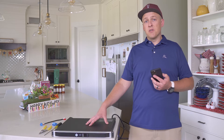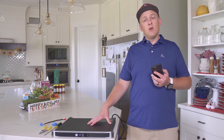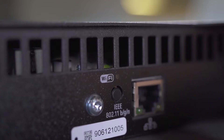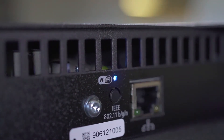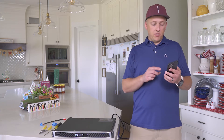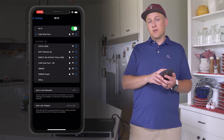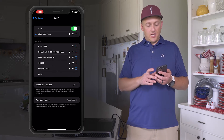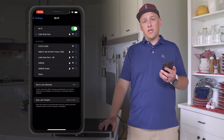For this project we don't have a network switch nearby, so we're going to use the built-in hotspot to load the DSP presets. Plug in the power, then reach behind the amplifier and press the Wi-Fi button. Once it turns blue on the front of the LEA amplifier, it starts broadcasting an SSID unique to this amplifier along with an IP address. Take your phone, go into network settings, and click on CS702-0005 — the same SSID being broadcast and shown on the LED screen on the front. Once it joins, jump into the GUI interface.